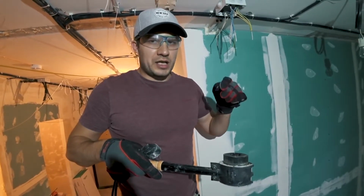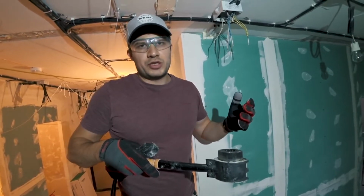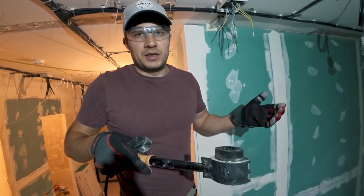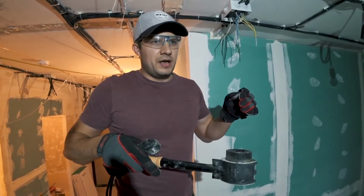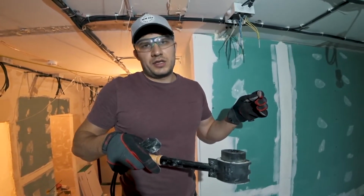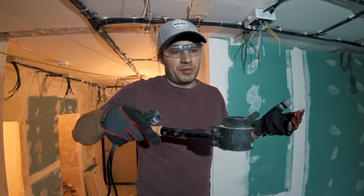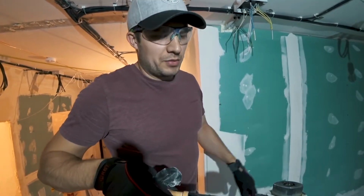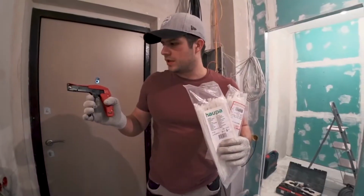The reason I use twisting wires and then soldering them later is that by Russian electrical code, it is allowed to use soldering in boxes that will be inaccessible. You could also use welding or crimping, but I prefer soldering. I know some prefer Wagos and other removable connectors. However, they're not allowed to be used in boxes that will be later inaccessible. Soldering is allowed by electrical code, and that's my personal preference. If you have your own, by all means, mention it in the comments. I always solder using gloves and protective glasses.